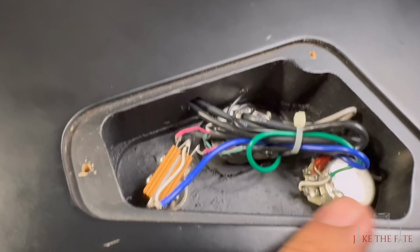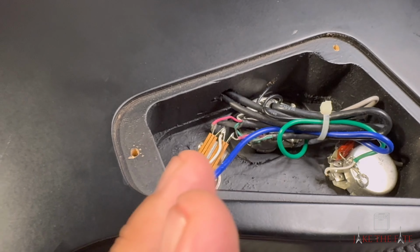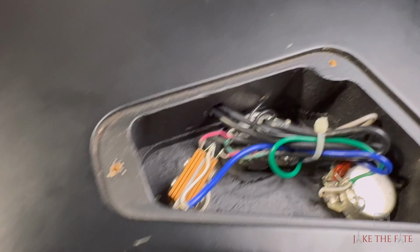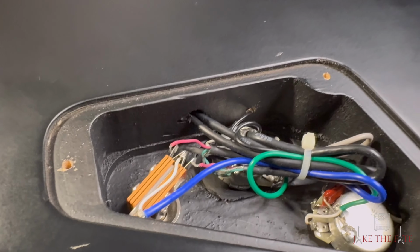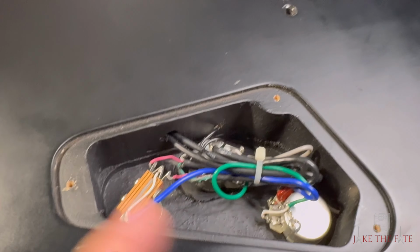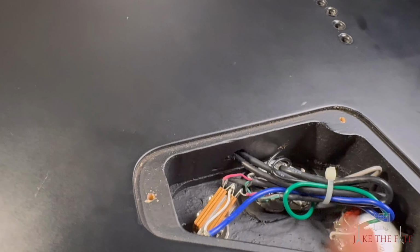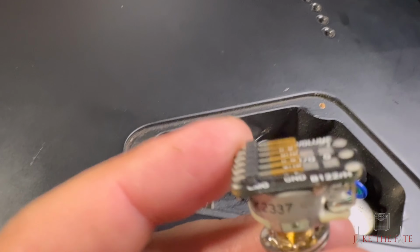So again, if you guys do want to grab a guitar like this, I don't know if the newer ones are like this, but I'm pretty sure all the guitars. And like I said, these pickups are passive, so they are wired straight onto the guitar. There's no batteries. They're not the active EMGs. Even with the active pickups, Schecter doesn't use the little clip-on potentiometers that you would get if you order EMGs. They solder everything on, and then they solder on the battery clip and everything's soldered on basically. So they don't use this kind of stuff.